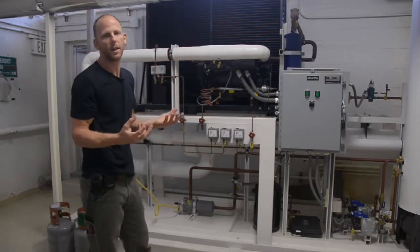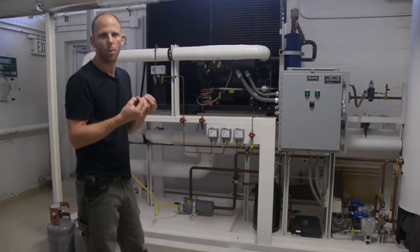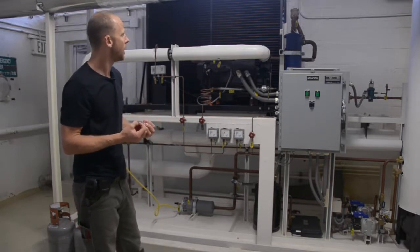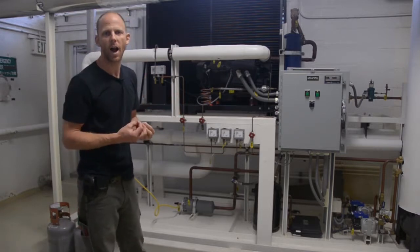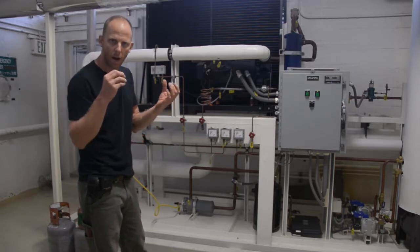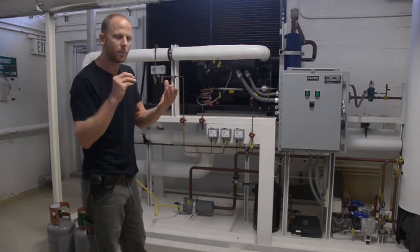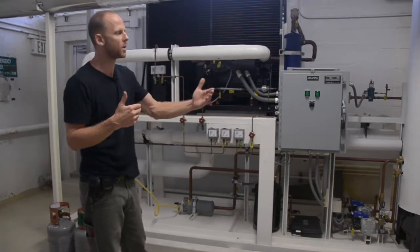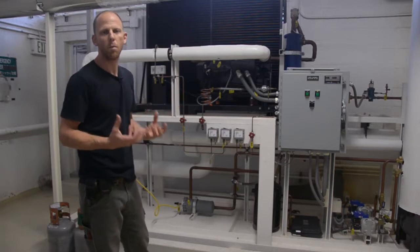And in that process, inside the heat exchanger, our high pressure freon is cooled down to a point where it begins to condense into high pressure liquid freon. Okay. We take this liquid freon and we move it through what we call a metering device or an expansion valve, where we have a pressure drop, and as that liquid expands through that metering device, it comes into thermal contact with our process air on the other side of the heat exchanging fins, and it begins to boil.